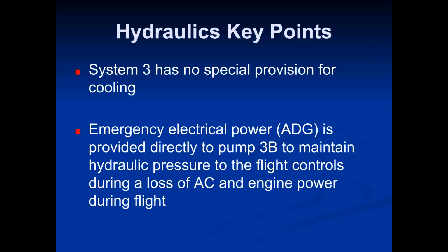Okay. Your primary sources of power are these engine-driven generators, which is essentially kind of like an alternator. Okay, that's your primary. So when everything's going good and everything's functioning normally, you've got a generator in each engine, and each of those generators powers up the entire aircraft. Everything, right? Every light, every bell, every chime, everything that you hear, see, do on an airplane that has anything to do with electrical power comes from those engine-driven generators, the IDGs. Okay, so those are your primary sources of power.